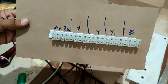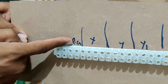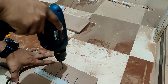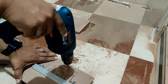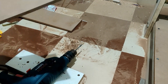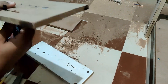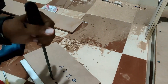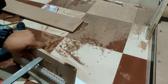I made this template for ease. There are 20 connectors total. P stands for probe, then ground, XYZ, and Y2. You need a total of 20 connectors: 4 motors, probe, ground, and spindle — 2 connectors for spindle. This represents the plate on the controller module — on one side you will have the stepper motor connections and on the other side the board. You need to make sure you provide space for the wires through the plate. This is just a test case; we will actually build the module differently.